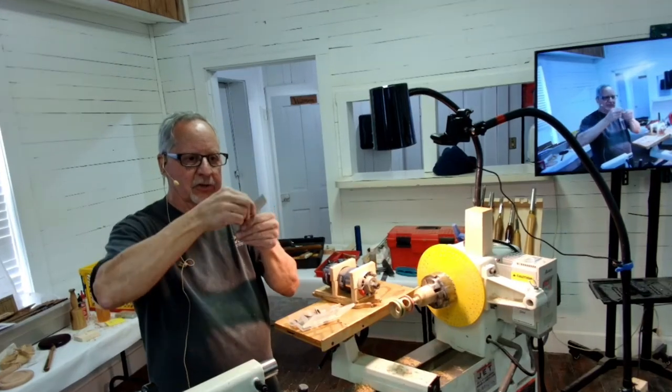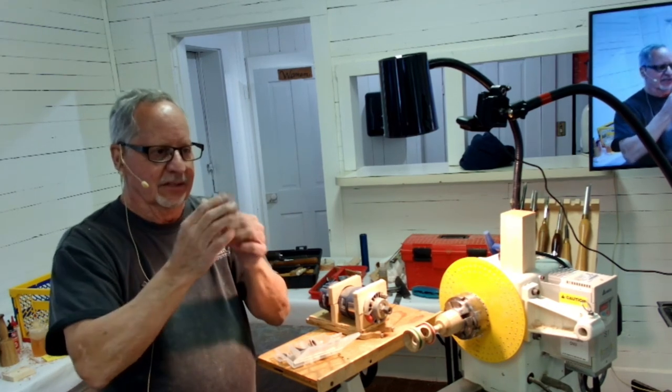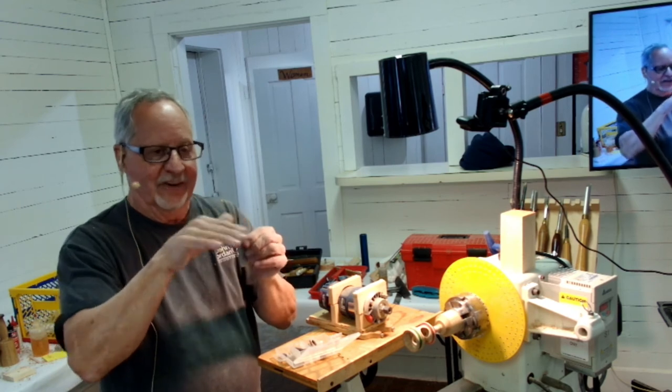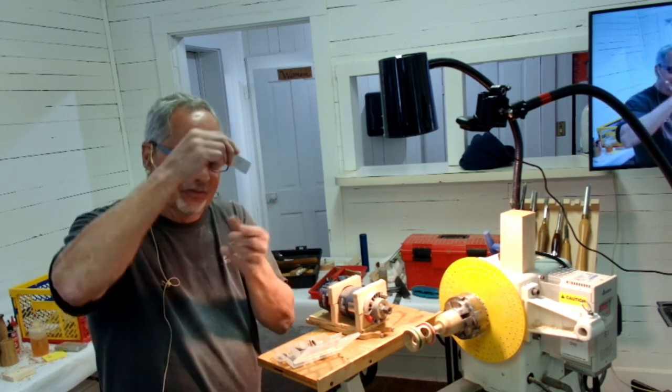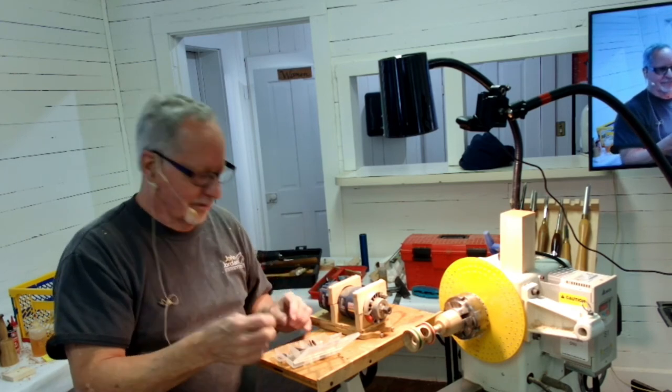What happened was I was cutting V grooves, and I put that square piece of wood in there, and it would rock in the groove. So I knew it wasn't cutting accurately. It's leaving a slightly enlarged hole. So I just hand filed that till it fit perfectly, visually through the light. And that's what I use to set up my table saw tilt to get that.